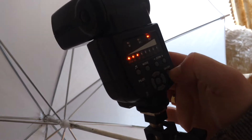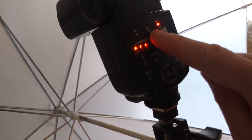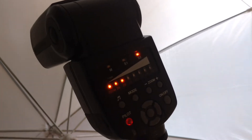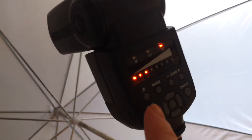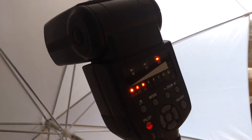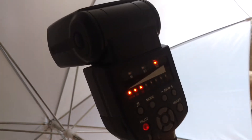These are just Yongnuo — cheap budget flashes available on eBay for not very much money at all. This flash can operate in manual mode, slave 1, and slave 2. Manual mode is when it's on the camera and it will just be popping off. Slave 1 and slave 2 are the optical slave modes. If we have a quick look around the front, that's the pickup there. You'll notice it's in slave 2. Slave 2 is the ETTL mode — this clever little flash, when the main flash goes off, doesn't trigger on the first flash; it triggers on the second. It waits for that first flash to go, then fires automatically. So it knows about ETTL flashes.